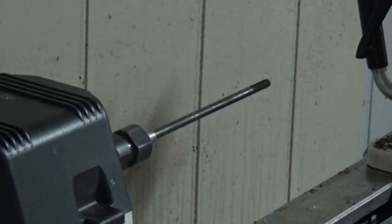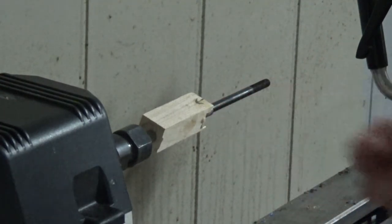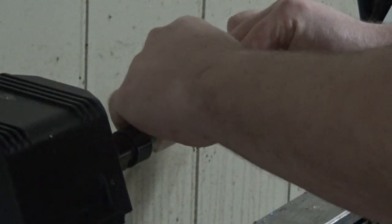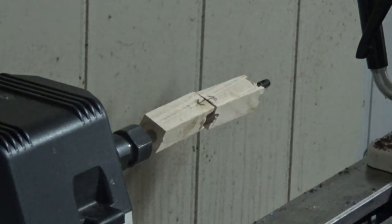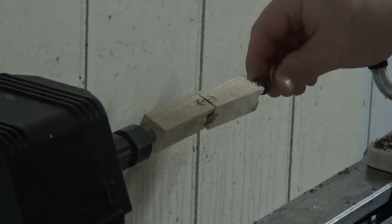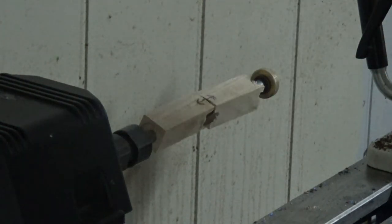So it has to go in this order: your first bushing, your first pen blank, your second bushing, your second blank, and you want to make sure that they are lined up. Remember those arrows that we put up earlier? Yeah, we have to make sure that they are lined up. And finally, the third bushing, and then we are going to seal it all up together and put the nut on at the end. So your mandrel should look like this.